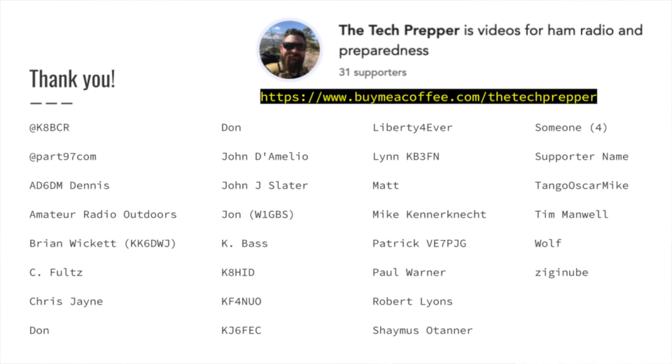Now for the MCOM Tools update — but first, a big shout out and thank you to everybody supporting me on Buy Me a Coffee, you have no idea how much that helps this channel. Last time I talked about offline off-grid FCC call lookups. I've built on top of that: since I have a GPS dongle on my Raspberry Pi, MCOM Tools can take my GPS coordinates and calculate the distance point to point to a remote operator. With two GPS coordinates I can also calculate the bearing — that's the new feature.